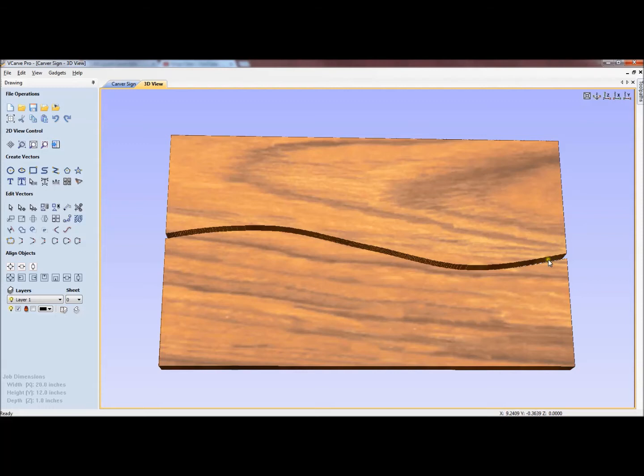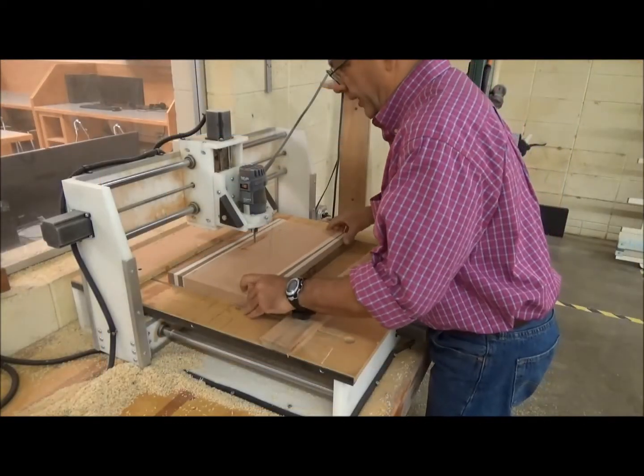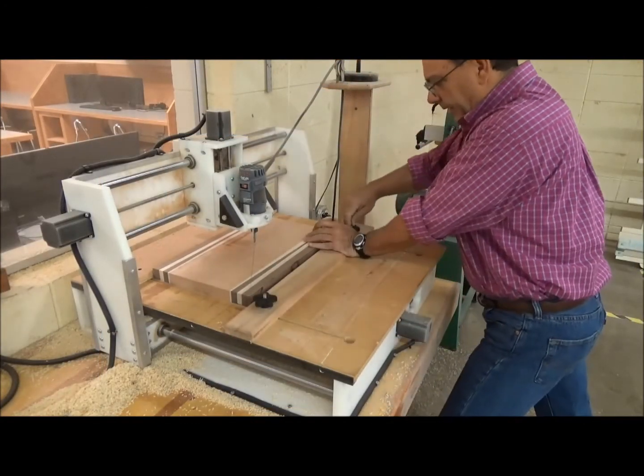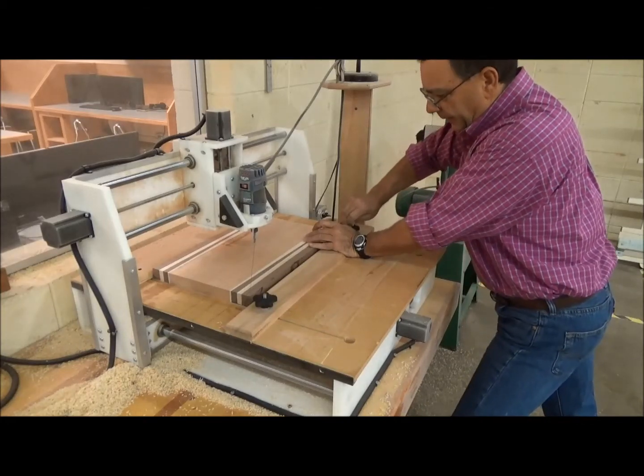What we're going to do then, in our laminated strips, as you've seen, is cut a quarter inch slot in it, and then we'll laminate 3 pieces that equal 1/4 inch. So we'll switch next to watching the CNC carver carve this tool path. I've got a cutting board here that's ready to go, and I'll place it in the clamp and clamp it in position.